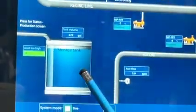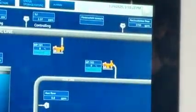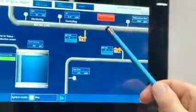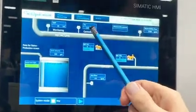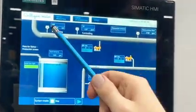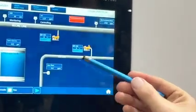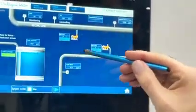So from the storage tank, in this case, we have two dosing pumps. These two pumps are drawing from this storage tank, injecting in these two lines, based on an ORP or on a total chlorine sensor. And of course, we have a flow switch saying that there is water going through these sensors. Based on the flow, these pumps are injecting oxidant into these lines.